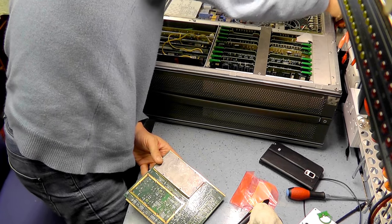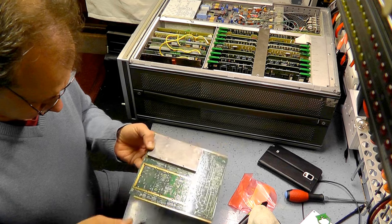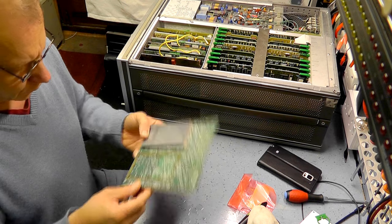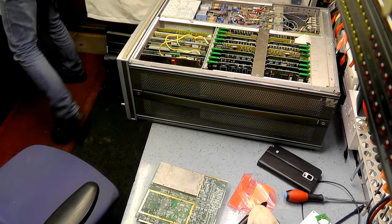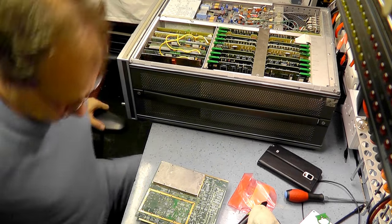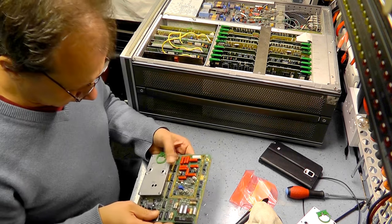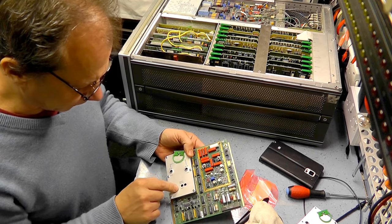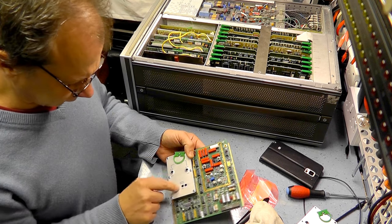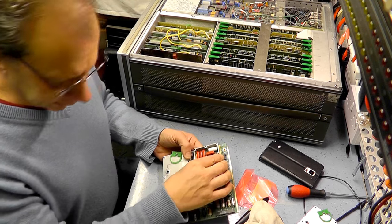Bring the high points off. They're actually okay — they're no higher than the existing ones, so that should be taken care of. Just left with the screens now to pop back on. There are a couple of adjustments in here we're going to have to do at some point — I'm going to have to put the board on the extender. These are the two offsets of the two differential amplifiers.